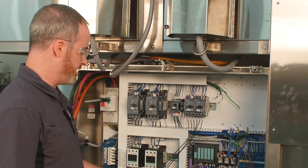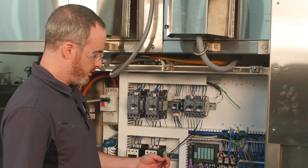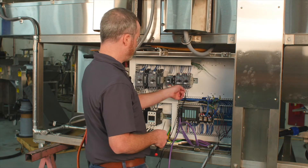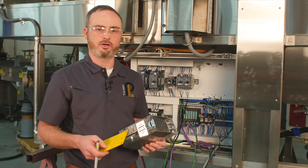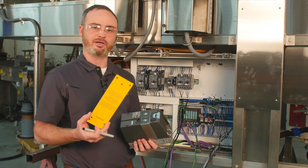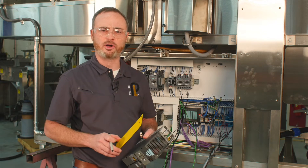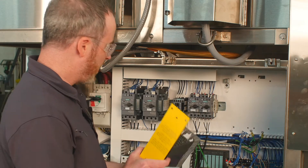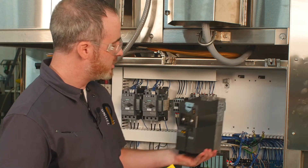We're preparing to put the new VFDs in place of the existing original VFDs. I'm going to reuse the high-power wires — just pulled back and cleaned up. The next phase is to put the power module into the enclosure in place of the MicroMaster. Use a Sharpie to mark placement and use the template to show the bolt pattern of the drive, so it can be quickly placed and squared up perpendicular to the wire duct. Physically fit the drive to confirm placement before proceeding.